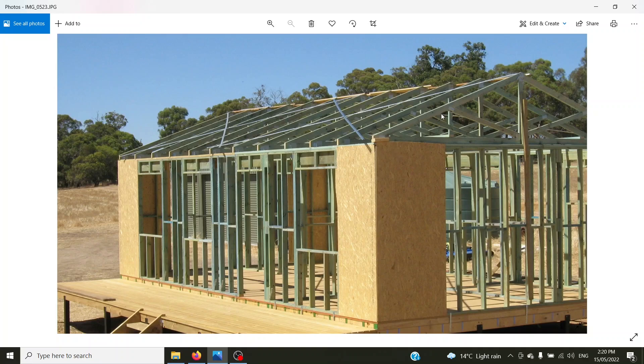That brace could have actually gone right up all the way. In America I know the entire side is clad; in Australia we don't bother with that, we only use 3x2 at 450 millimeter spacing or less. The roof trusses are at 900 spacing — that's three feet. Before the diagonal braces went on, this entire side of the building would belly in and out and the roof trusses would shift sideways even in the wind. So diagonal bracing is very very important. You can also use metal bracing on the walls, but when you've got windows to work around, timber bracing is a good way to go. These timbers are 10 millimeters thick — that's about three-eighths of an inch — and OSB board.